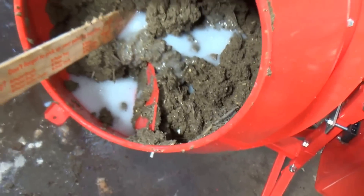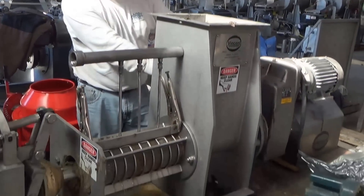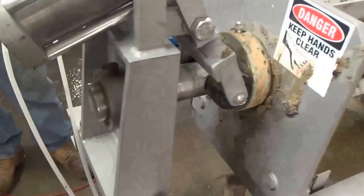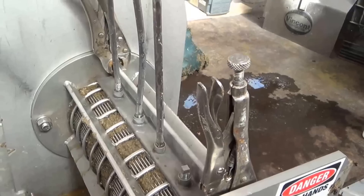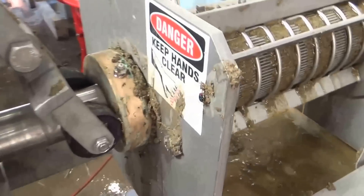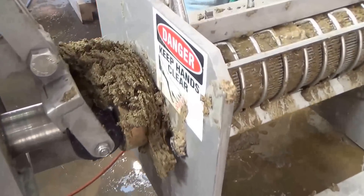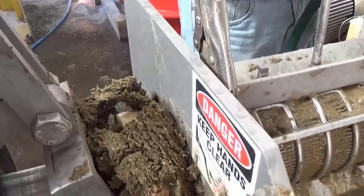We've added some more polymer — so this is what we'll be putting in the press. We've started feeding the material with the polymer. It's coming through — I'm going to close that discharge cone, still at one bar, running 18 rpm. The material is feeding and spitting with liquid coming out on both sides. The cone looks like it's going to open on its own accord. We slowed down to 13 rpm — down to 30 hertz — and got rid of the channeling. The cake is coming out all the way around the screen.